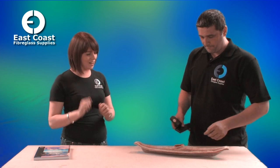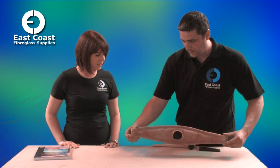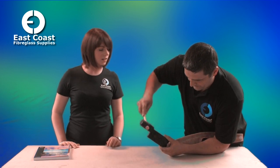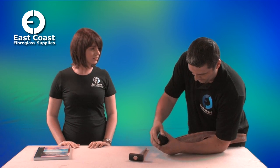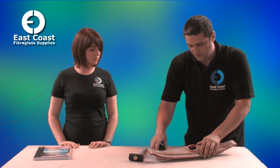So there you go, that's how he did it. And now to show us the finished product, here's Martin. So you're going to show us how to take it out of the mould now? That's right. So what you need to do first, before you start to take it out, is trim all the raggy edges off — take all the raggy parts of fibre and straighten out the flange area. Then just stick the wedge in and tap it in with the mallet. There's plenty of release on there, so that's popped straight off. Otherwise you'd just have to go around and knock in a few more wedges.